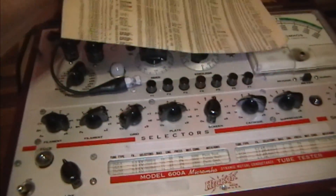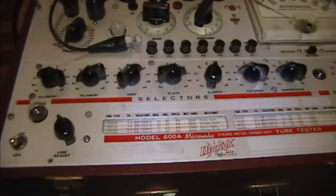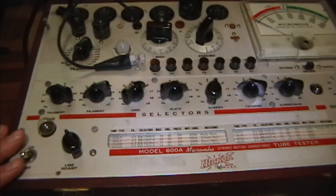I also took a look at this paperwork that was inside the lid and found something kind of interesting. It says this is a condensed reprint of the roll chart dated October 1, 1957, and contains all the older type tubes. In order to save room on the new chart dated January 1, 1958, for new tube data, it was necessary to delete data on older tubes. So I'm very glad this is intact and in good readable condition, because none of these tube types are going to be in the roll chart. This also gives me a date range - assuming this is accurate, the chart is from 1958, which is pretty good for me because my newest TVs are from around 59-60, so there's a good chance every tube in every TV I've got is in this roll chart.